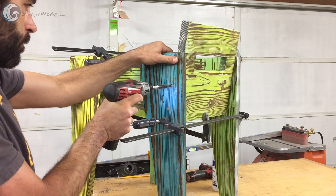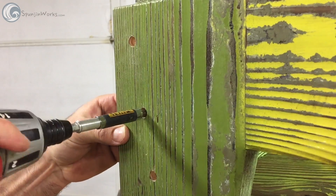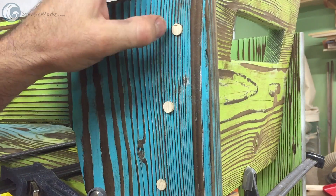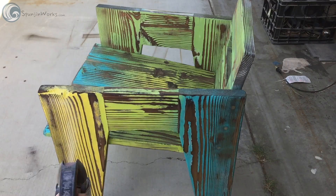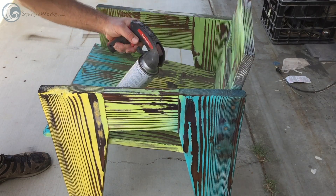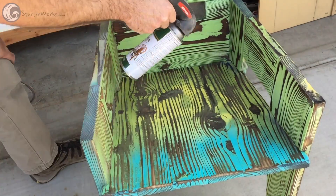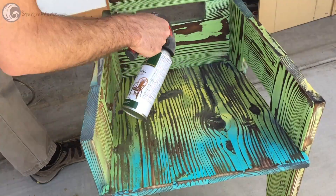The back was attached with six screws, and to cover the holes I inserted some flat plugs, burnt them, painted over, and hand sanded one last time. The finish I used was Deft glossy waterborne acrylic. I found I didn't like this brand as the spray pattern wasn't as atomized as the similar rattle can finish that Minwax sells, but Deft was half the price so what could I expect?